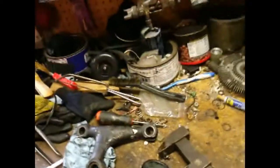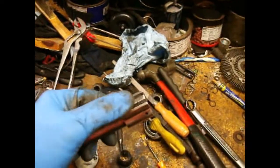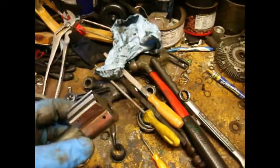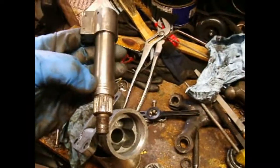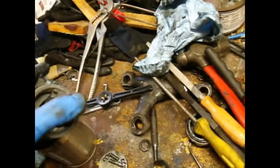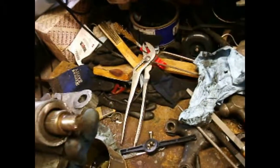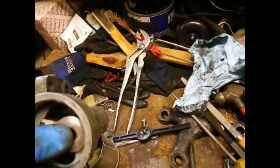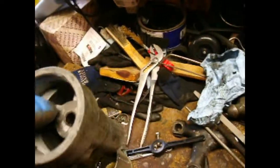Here it is - this is that sweep. These two black squares are actually just rubber strips, and there's a steel bushing inside of this aluminum casing that this rides in. This had a few marks on it so I've cleaned that up. That goes back through there, and there's also a seal on the bottom - a rubber seal. I just don't see a way to replace that, because the aluminum has swedged over it, so some of it's broken away there on the top half, but the bottom half is there.